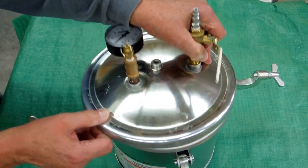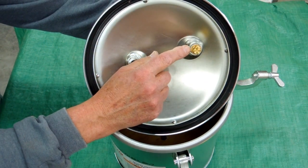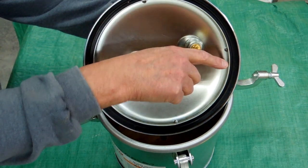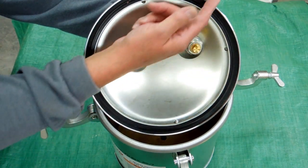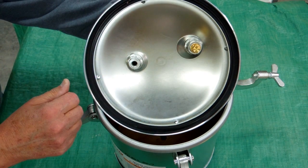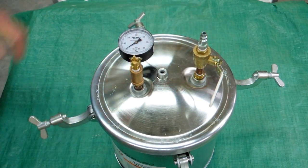One other thing I've done in here: I screwed in a pipe plug and cross-drilled it in both directions, so when the air comes in, it goes in different directions and is not blowing directly down into my container of resin or blowing stuff all over the place.